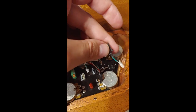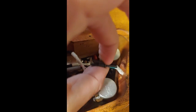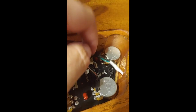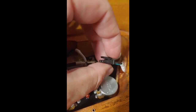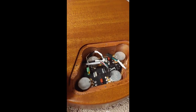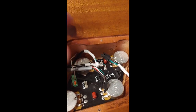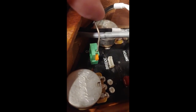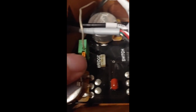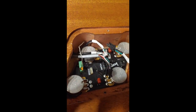Then the ones for the jack and the switch, they hook in right here, and you're supposed to be able to push and pull. It worked just fine on the input jack — I just pushed the little clip and it pulled right out. The switch was a little bit trickier, so I just got my little half-a-plier tool to pry on it gently while I gently pulled it out. The only one I haven't figured out yet is this ground wire. That's going down to, I presume, one of the bridge posts, and the ground goes in right here somehow. I have not yet figured out how to do this.